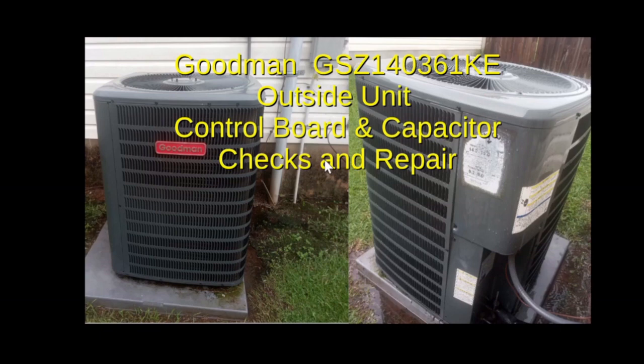Of course, I had to do some other work on the outside unit, and not necessarily because that was the problem, but also because I was troubleshooting and trying to find the problem. So the problem was mainly that one relay, but I did find some other issues with the system. Again, in my case, the system would not come on at all. The system would just not respond to the thermostat inside. I checked for power, checked for tripped breakers, checked for fuses, and those were not the problem.